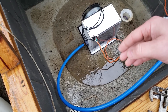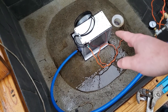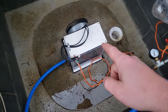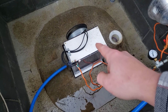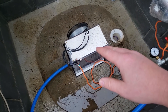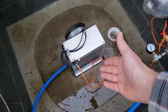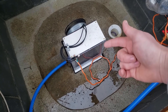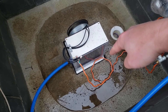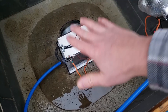This is all stuff I'm learning for turbine 2.0. This is turbine 1.0 using some free parts I got — not necessarily optimal, but pretty good. I have some water leaking out, so for the next revision it would be a good idea to rotate it, since you've now seen how it works on the sides. I'll rotate it so the axis of the motor is vertical, remove the bottom plate, put the back on it, and remove one side so it's open to the bottom.